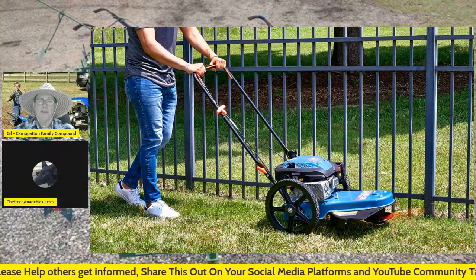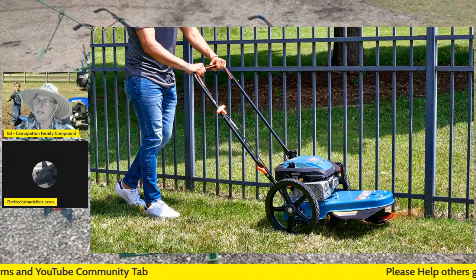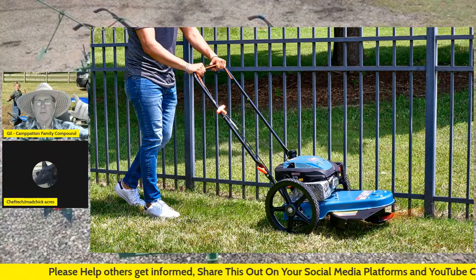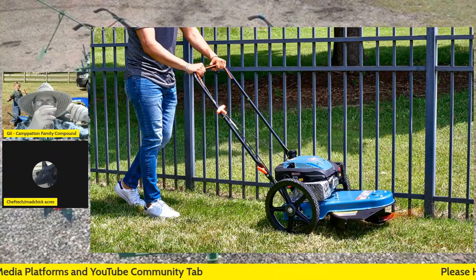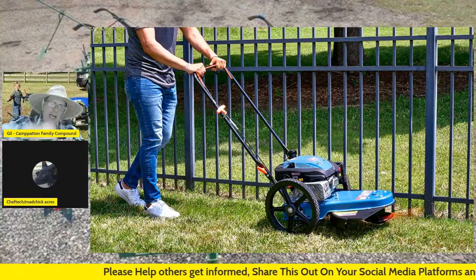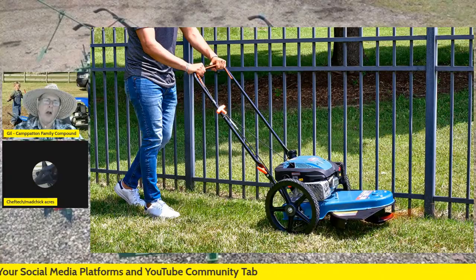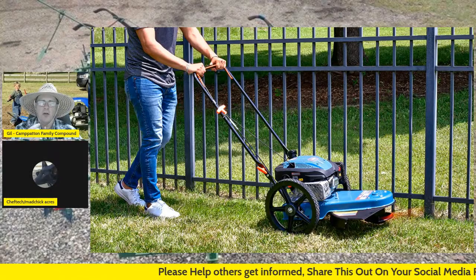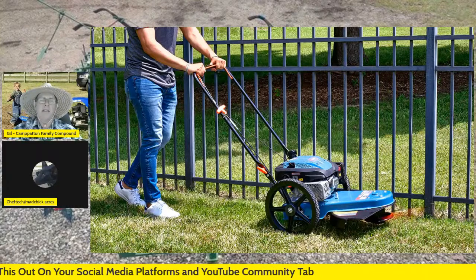Yeah. I'm debating it really, because some of the stuff I have, I added on. I did a video on it, and I added up here on the side opposite the pull handle, I took a piece of 1 inch PVC, put a cap on the end, glued on a male thread piece, and then I made a female thread piece, a short piece of pipe and another cap, and I stuffed extra strings in it, like a half a dozen or so changes, and then screw it on there. So if I'm out there in the field, I don't have to stop and walk all the way back to get extra strings. And they're all pre-cut to the right size. And these are heavy-duty strings. I mean, the stuff you use on your normal weed whackers, they're like, feed me, I want to grow up to be like that. It's like 10 times the size of one of those other ones.